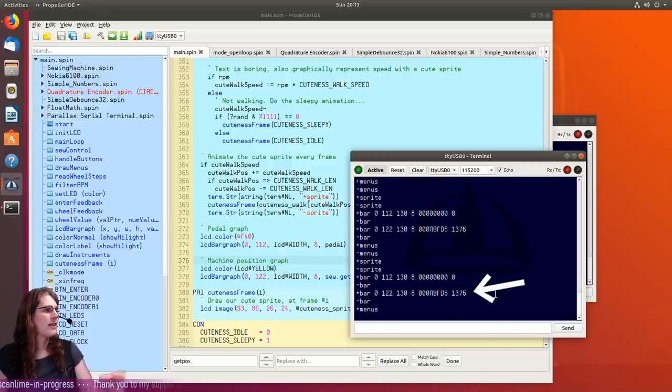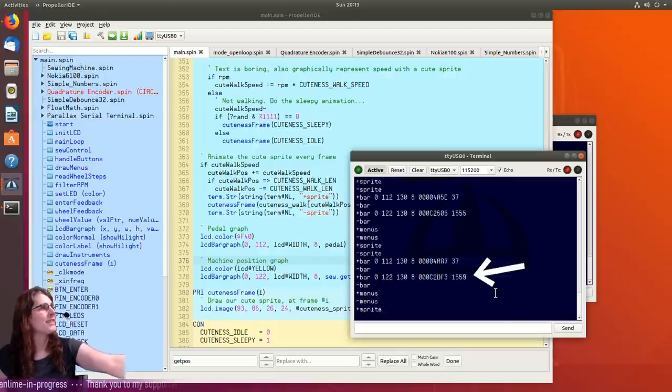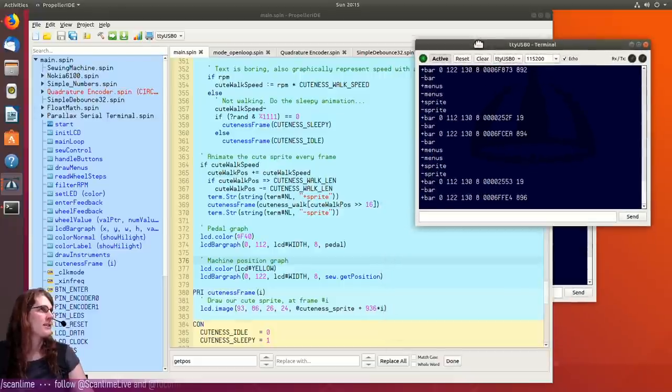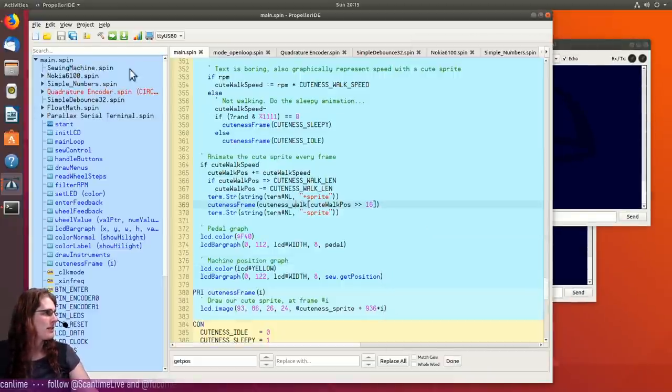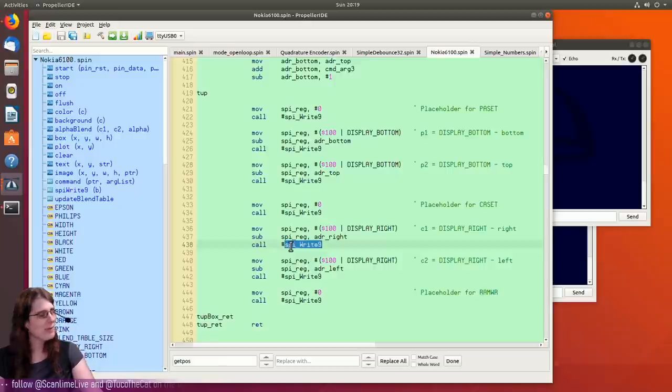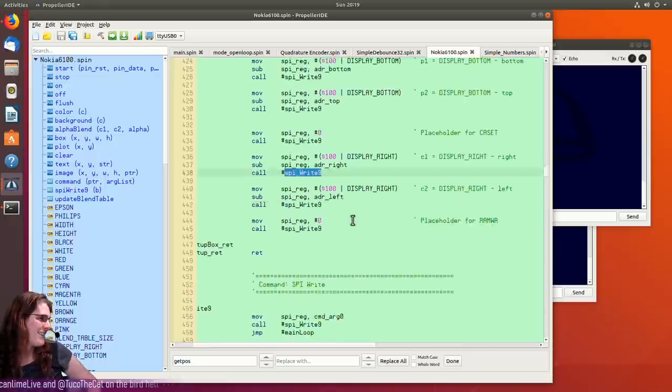Yeah, so in bobbin winder, that bottom value just keeps increasing. Like, this explains why we're calling the bar graph routine with more and more ridiculous numbers, but why does the bar graph routine suddenly crash? Is this why we're getting the wrong upper bit in that SPI command, I wonder? Gosh, so all the LCD flickering and going berserk wasn't even EMI. It was us stuffing the width of that progress bar as it overflowed and overflowed and overflowed into the command register of the LCD controller. Oh, that's terrible.